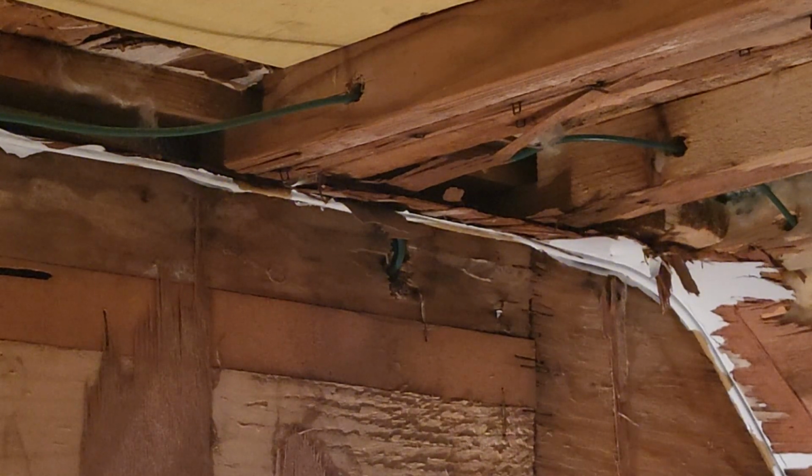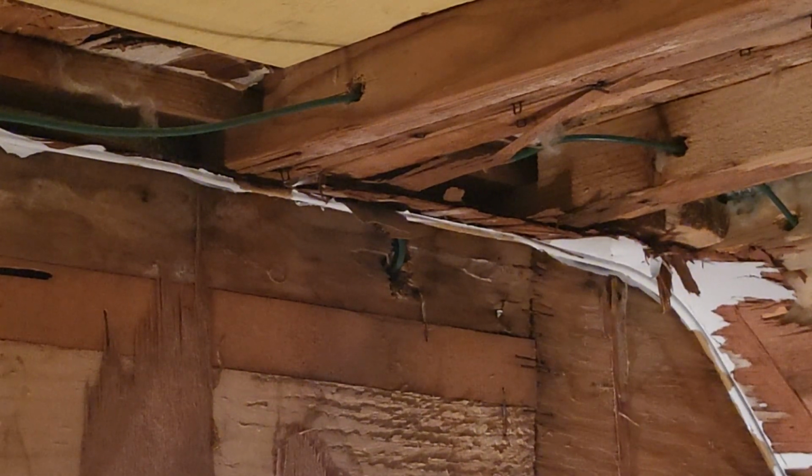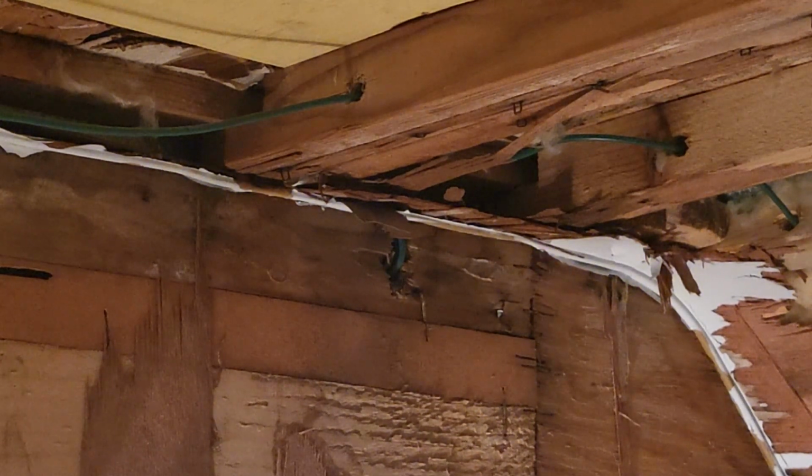Or do I frame the walls out, do foam out to 2 inches up to the hardboard, and then try and squeeze what hardboard or what foam board I can in the top. I think it's going to be easier to do the roof first, foam anyway, and then frame the walls out to 2 inches underneath that foam. That comes down to 2 inches.